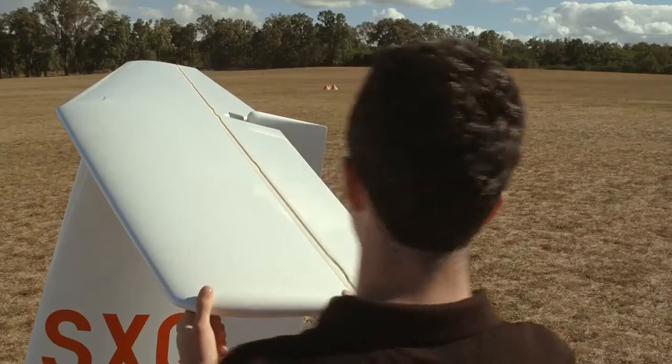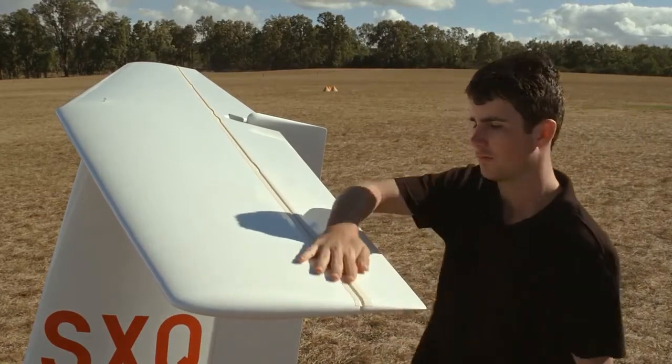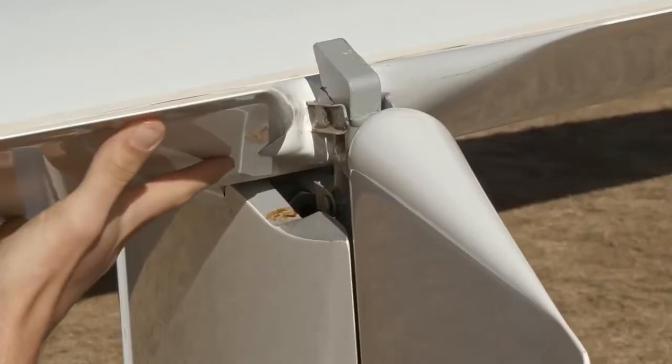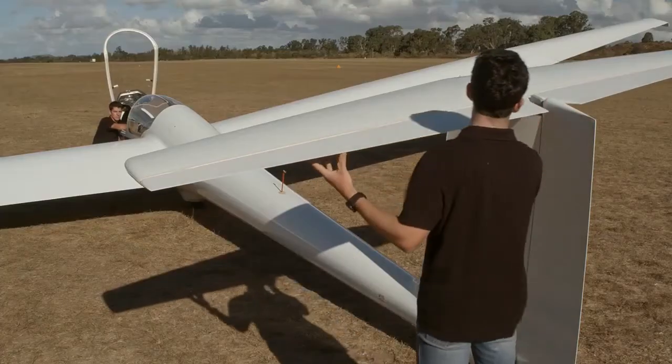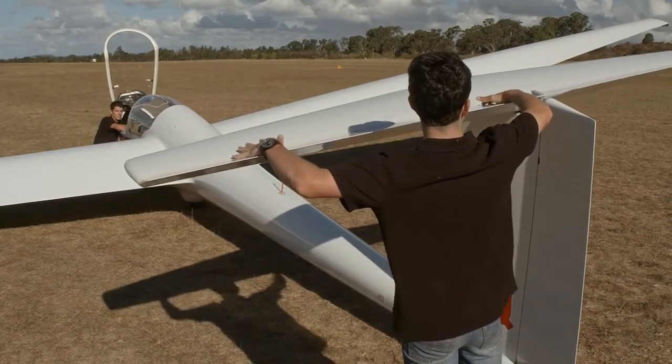Like the ailerons, check the hinges for play and that the gap seals, where fitted, are intact and not lifting. Don't forget to check that the elevator connection is safe too, by checking the coupling, and testing for play while a helper holds the control column in the cockpit.